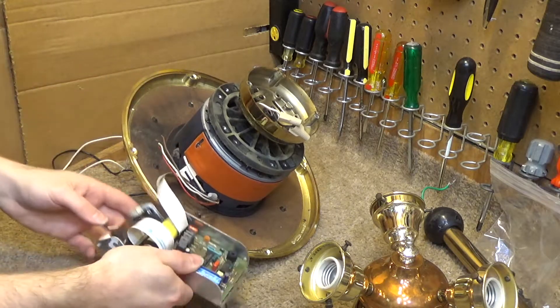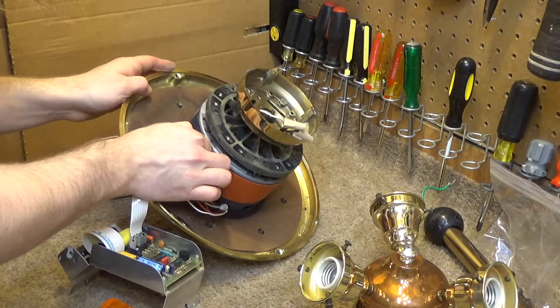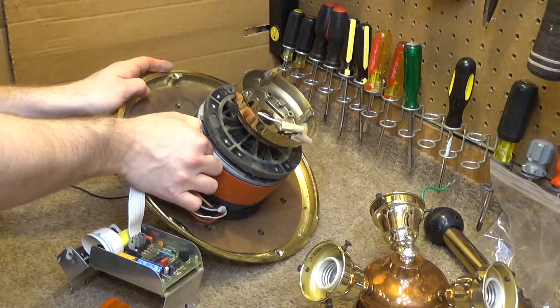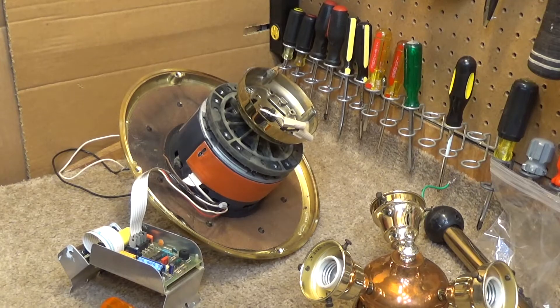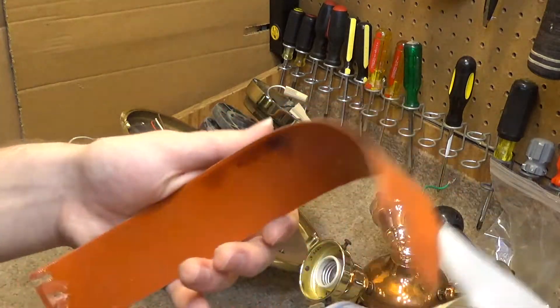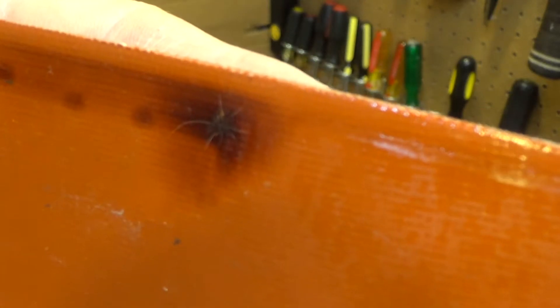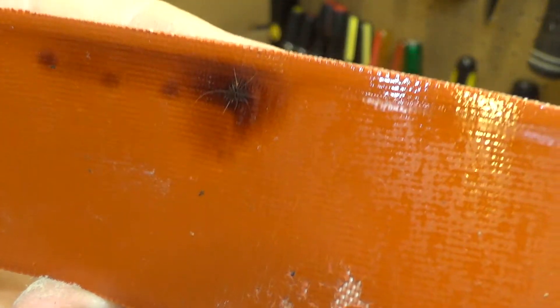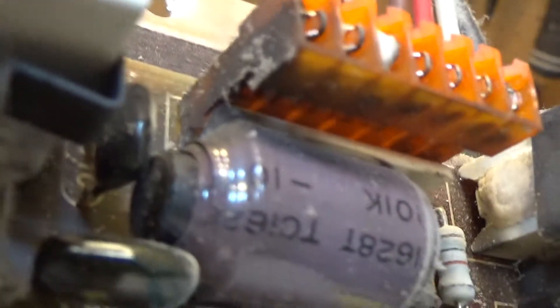That is evidence of something getting very hot. This does need to come off. Again, I don't know what it is or what it does, but it's got to come off. Here's a look at that crazy piece — I have no idea what in the world this could possibly do. But you can see here that it does have some evidence that it got very hot at some point, and perhaps shorted out or deteriorated. Which likely renders it non-operating correctly. There's also some evidence on the board itself that it got very hot, particularly by that main connector there.